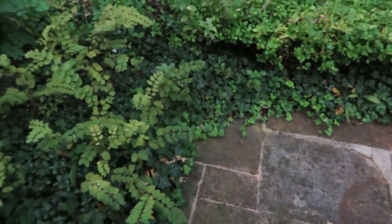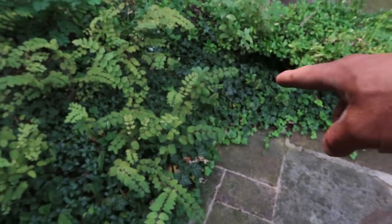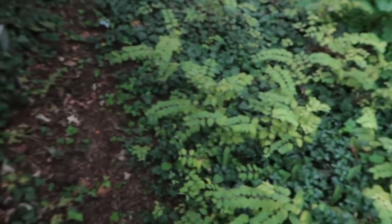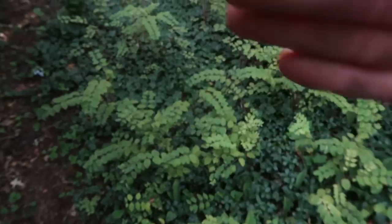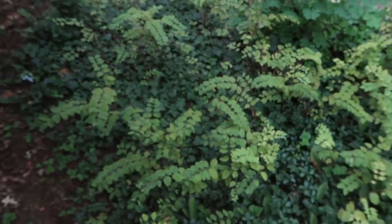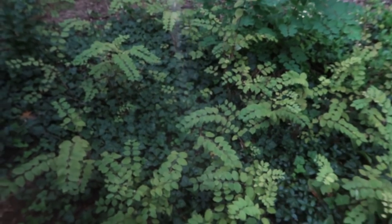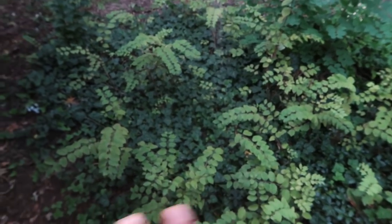In this upper area, we are going to continue this natural stone - it looks like a sandstone of some sort - and we're going to do kind of a quarter circle that takes you all the way back here. It'll go out probably about four and a half feet, and we'll build a brick wall inside that pond edge to hold up that patio stone so you can actually sit on the patio or this little cafe table area and drop your feet down in the water.